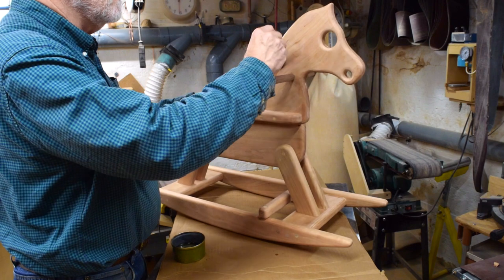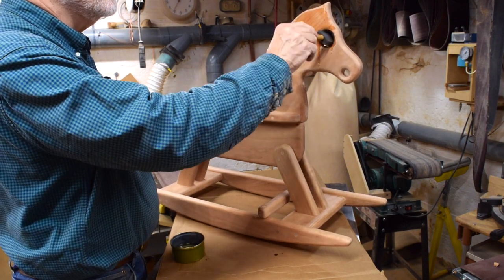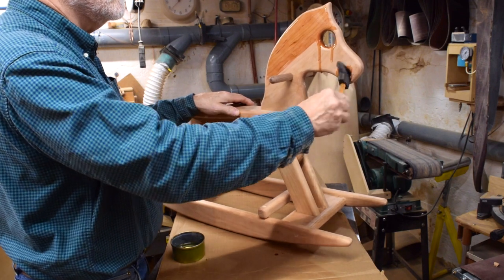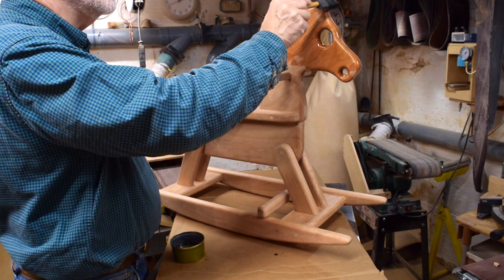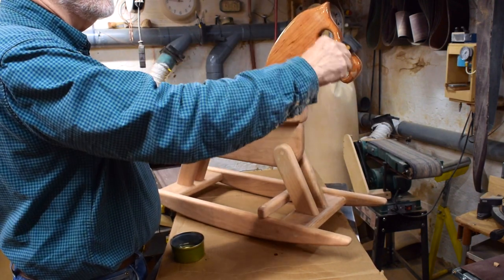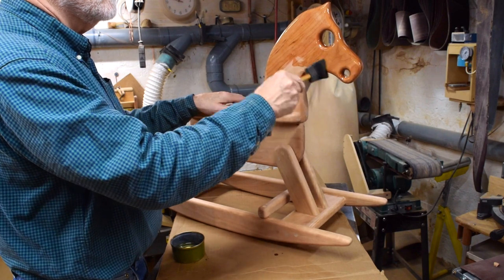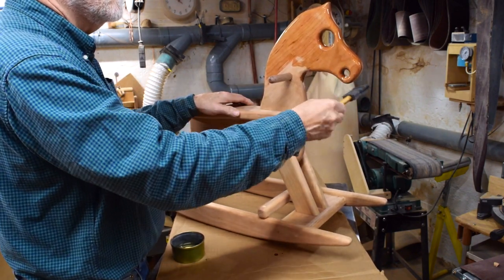And when you're done sanding, you can do the really fun part, put on the oil finish I use. I use food-grade walnut oil. I buy it at the grocery store or from a supplier to grocery stores. It's edible. It's a traditional wood finish. It's a drying oil, and after 3 or 4 days, it's ready to ride.